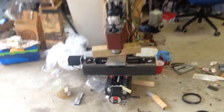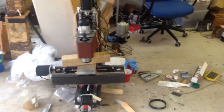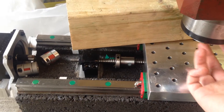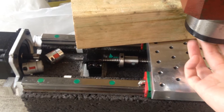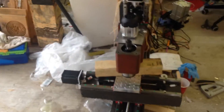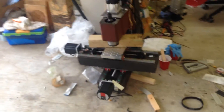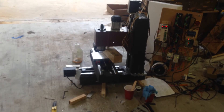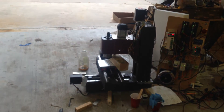There's the power drawbar over there. Right now it has a Morse taper on the inside — it was cheaper than R8, but I'm probably only going to get R8 tooling from now on. Hopefully soon I'll get some videos of it running. Thanks for watching.